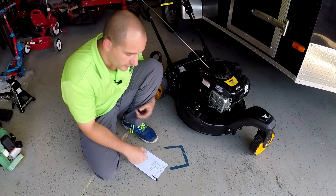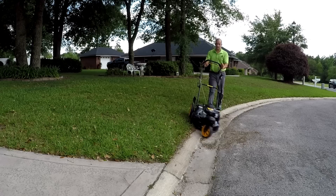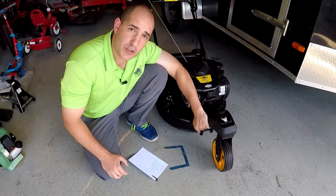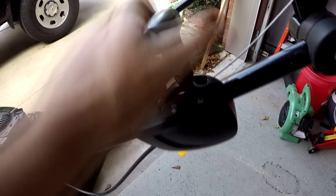When you're going on a slope, gravity is pulling the front of this mower down and you have to fight it, so it's wanting to dip down to follow that slope downhill. Very frustrating. The locking feature does work and it's nice, but if you have a yard where you have to lock this mower for any extended period of time, you might as well just get a four-wheel mower. One of the great benefits of this machine is the maneuverability — you don't have to pick it up to turn it. But if you've got to lock that front wheel because of slopes, you're basically better off with just a cheaper four-wheel push mower.